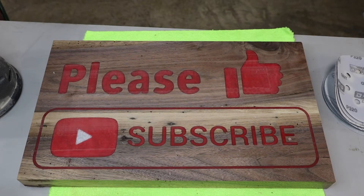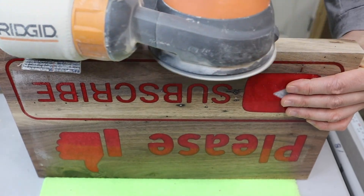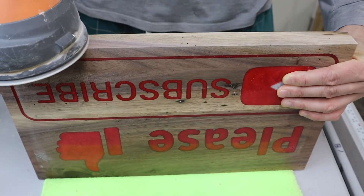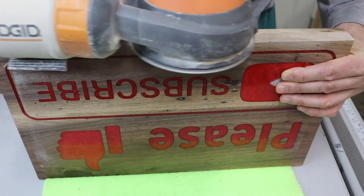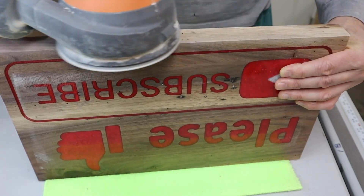This is the result after a couple of trips through the planer. It looks good, but still needs hours of sanding. I sanded the sides and back from 120 up to 320, and the presentation face far beyond that. As usual, I apply finish to all sides so seasonal fluctuations in humidity cause the wood to swell and shrink uniformly. I only needed to ruin one tabletop several years ago to learn that lesson.